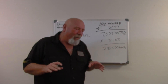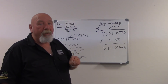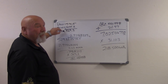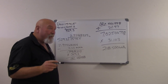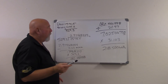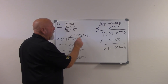This process will get you very, very precise, and you're going to see very quickly that we lost some gold weight by doing the proper specific gravity test. We're going to take our dry weight and subtract our submerged weight, and that comes out to 529.3. Our next step is to take our dry weight of 1574.5 and divide that by our subtracted difference of 529.3, which comes out to 2.97468354.